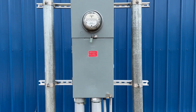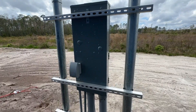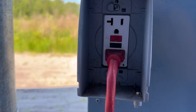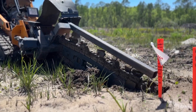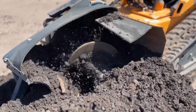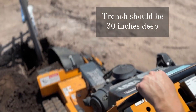Our pedestal is about three feet in the ground, so we didn't use concrete at all. Now we're going to tie in our PVC conduit from the road, and also set up a temporary outlet for power. That outlet can be put on the rear or side of the panel — we chose to put it on the rear. We had to rent a trencher, run three-inch conduit from the road to the pedestal, which is approximately 75 feet, and we had to make sure we made it 30 inches deep.